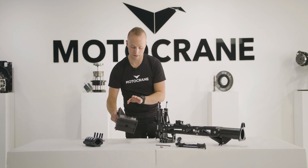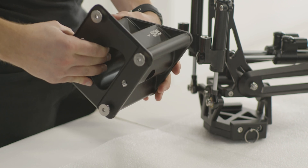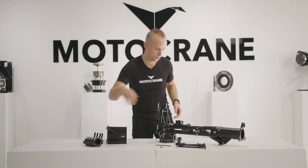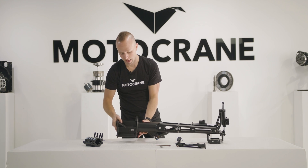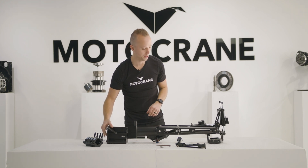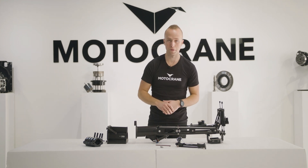Moving right along — this is the SRB, or the Speed Rail Rigging Block. It's machined from a single billet of 6061 aluminum, so it's really light and really strong. On the front you'll see that bolt pattern we were talking about earlier. This is how the Ultra Isolator would mount up, and then you'd install your three M12 bolts. Everything on Ultra is M12 wherever we can possibly design it in — there are some M6 elements, but these three fasteners are all M12.